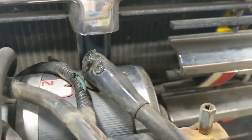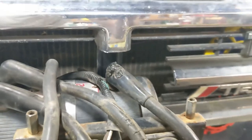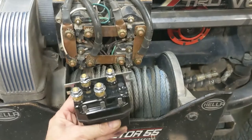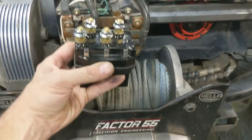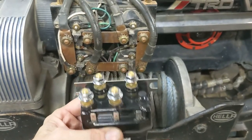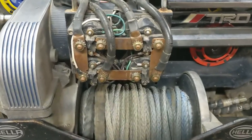You can see right here it's been overheated at one point. This motor — not that it's questionable, but it should probably be looked at anyway. So what we'll do is we'll eliminate all of that. We'll be replacing the four solenoids with this single Albright contactor. You can see it's quite a bit smaller — should be a little more compact and less problematic. We've got sort of two units in this one as opposed to four different units.